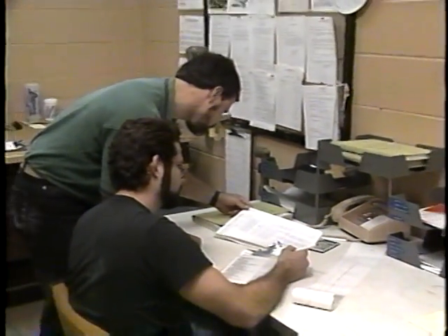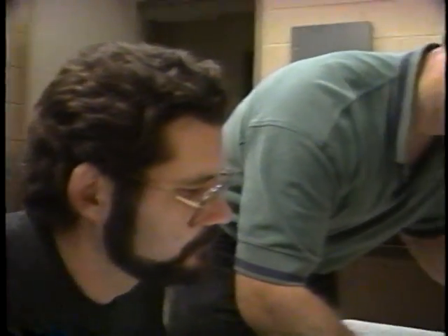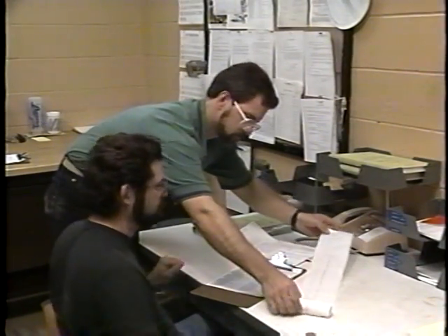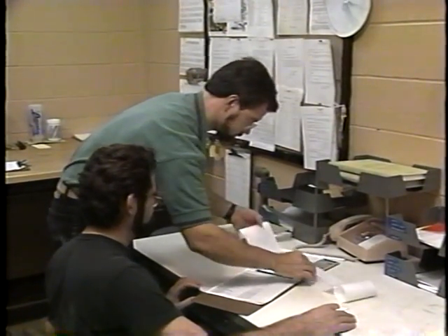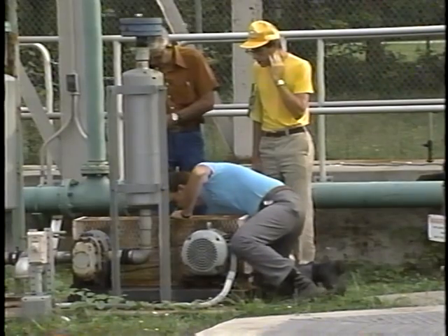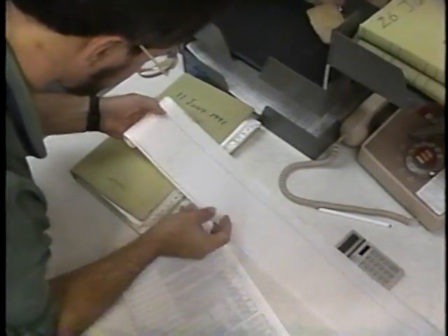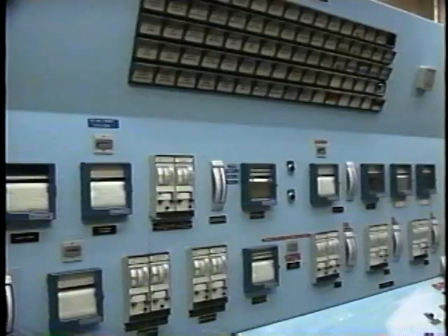It's also a good idea to evaluate data handling, reporting, and quality control of flow measurement. The wastewater treatment plant is required to maintain records of data for three years. Review these records and note the frequency of routine operations, maintenance inspections, flow meter calibration, and the uniformity of the flows reported. Quality control areas to evaluate include proper operation and maintenance of equipment, accuracy of equipment, accuracy of records, valid flow measurement techniques, precision of the flow data, and frequency of calibration checks.